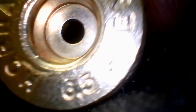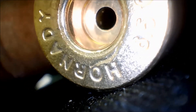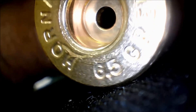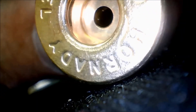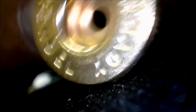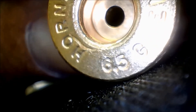Here's another one I wanted to show you — I mentioned in previous videos there were marks on it. Right there above the H and the O, see that little squiggle? It's a groove, and it looks like it was done during forming because this has never been fired. I've seen this on probably at least 30% of the lot. All of them have this rougher appearance to the face, but a lot of them have these wrinkles. Something's up, because the cases don't look right and they're not lasting as long as they should.